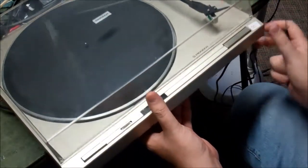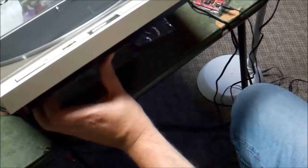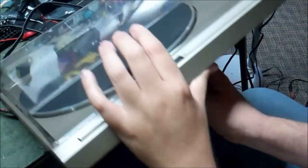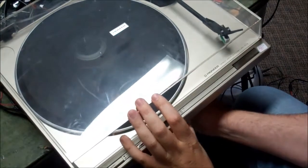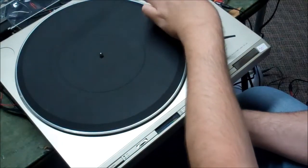Going from the last Pioneer I did, there are a couple of adjustment screws down here on the bottom. They put two pinholes in them. You put your precision screwdriver in there and you can catch them and tweak these pots a little bit. One of them runs the 33 and the other one runs the 45 based off the 33. So I don't know which pot I'm actually tweaking right now, but it will affect either one or both speeds. Let's try to run this again and see what happens.